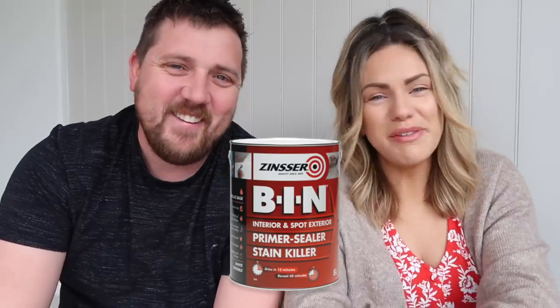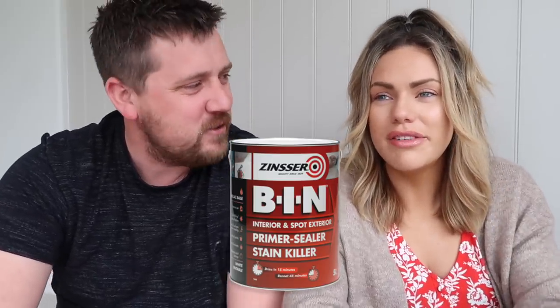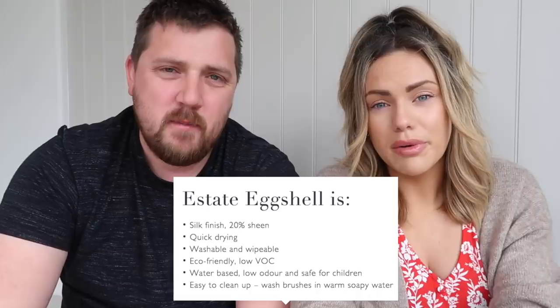What type of primer and paint did you use? Our favourite — we should be sponsored by Zinsser! We use the Zinsser BIN primer, the red and white tub, first on the cupboards. Then we use Farrow and Ball Cornforth White. We actually bought it directly from Farrow and Ball because I wanted the estate eggshell finish — it's got a nice sheen, not as shiny as satin, and it wipes clean. It's more durable than matte. We did two coats of primer and three coats of Cornforth White.